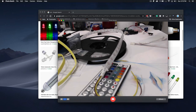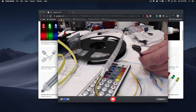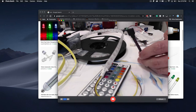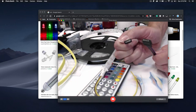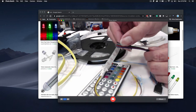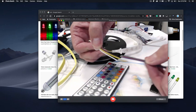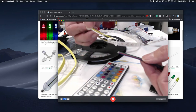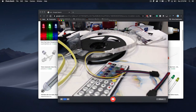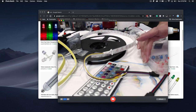When you connect things together, there are a lot of different connectors out there — just be on the lookout for them. You'll see these very commonly. They come in three and four prongs. These are the female ones, they have the holes; these are the male ones, they have the little prongs. At the end it's just normal cable wire. You have to make sure that these get soldered together, but there are other solutions too if you don't want to solder.